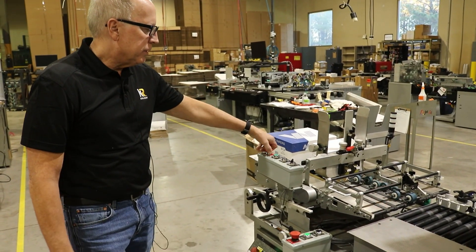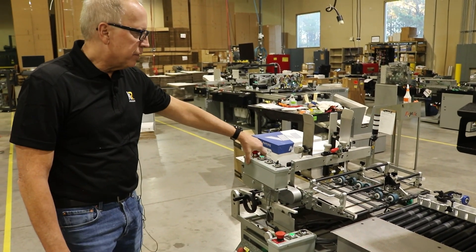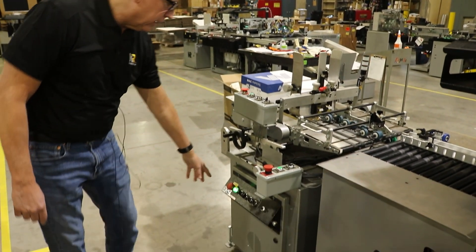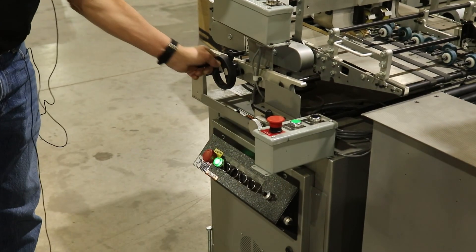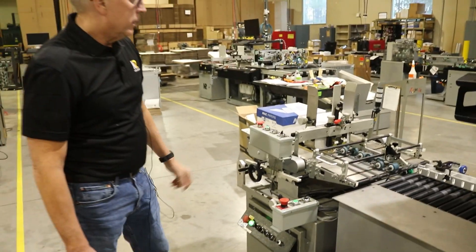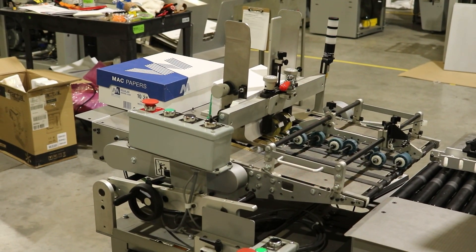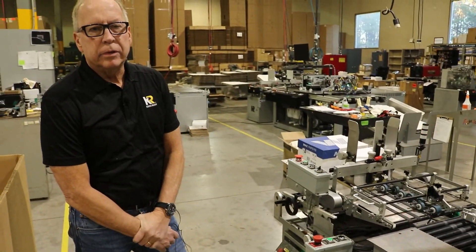The first part of the system is this high-quality, high-speed feeder. This is a friction feeder by Kirk Rudy, called the 497BW. It has servo feed functionality and mechanical cranks for easy alignment and setup for operators. The feeder can accept up to 18 by 18 inch long and wide sheets and is able to stop and start immediately based on inputs.